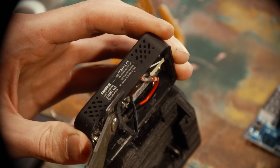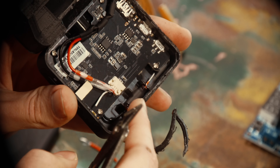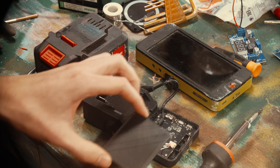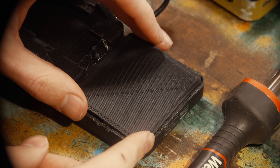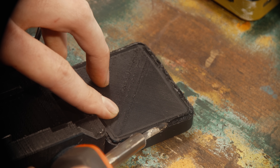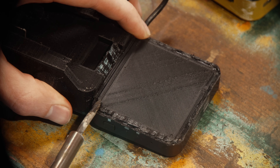Another potential mod — I believe this is the antenna, and I kind of wonder if I soldered some extra wire onto that, if it would receive better. But I'm not using it for long range, so I'm not going to worry about it. That print is done. I just made a little 2mm sheet that's really just going to function to keep dust out of it. I'm going to melt this in place for now, because the next time I need to open this, I'd probably just print a whole new case for it entirely.